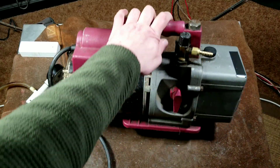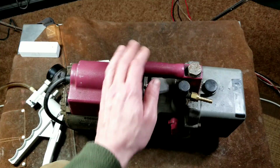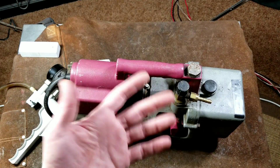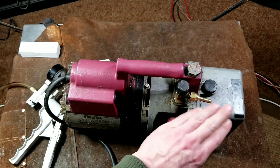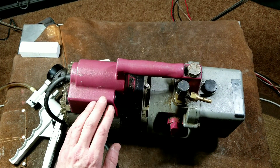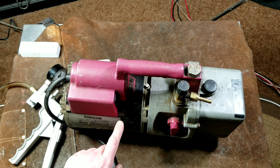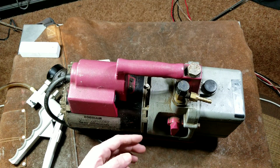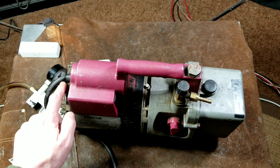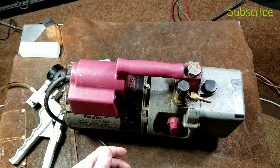Because they're fairly common, I found this one for $25 at a home improvement recycling center in town. It's obviously an older unit, pretty dirty, but it actually worked fine — it still had oil in the pump housing. The Robinaires are pretty nice. This one is rated half a horsepower and uses a General Electric induction motor, designed to run continuously for hours at a time. It has oil caps on the front and back bearings for the induction motor, and no brushes in the motor so it doesn't ever wear out.